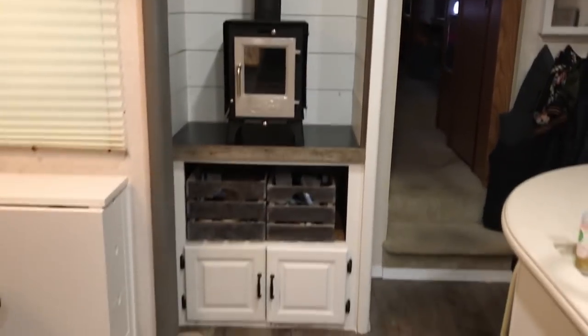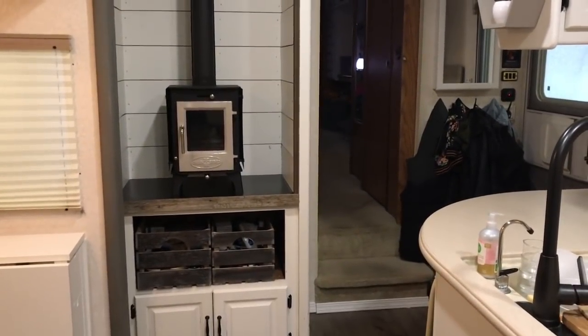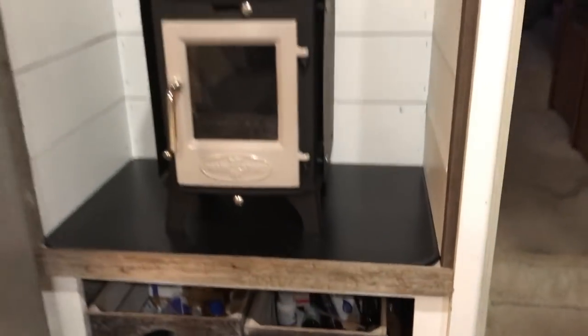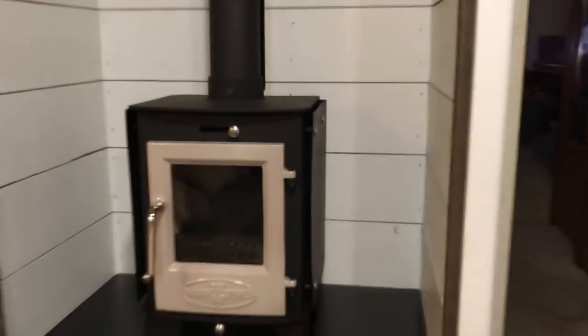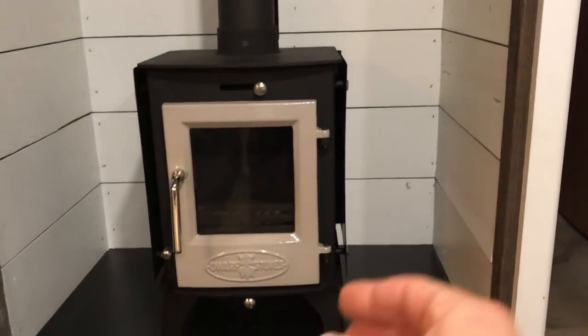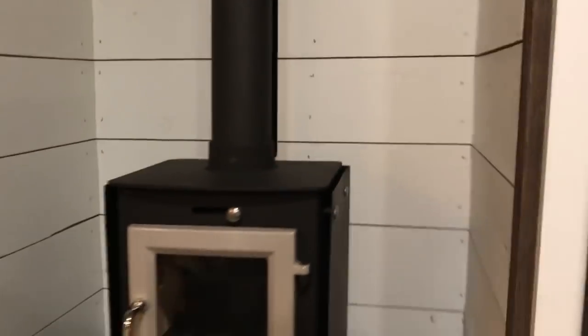This is where the stove is going. Before we remodeled, this was an entertainment center with shelves, a TV, and sound equipment. We ripped that all out and put in a little hearth — a pre-manufactured heat shield with thin metal and ceramic insulation under it. Then we added some shiplap and barnwood trim. Instead of heat shielding the sides and back, we installed a heat shield on the stove itself, keeping about seven-eighths of an inch air gap for airflow, and did the same with the single wall pipe.